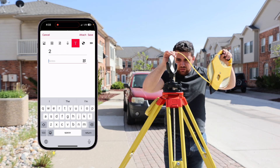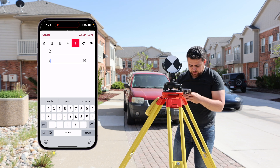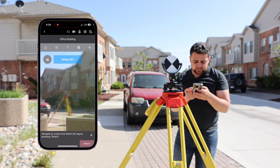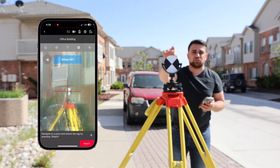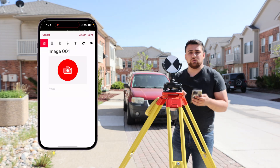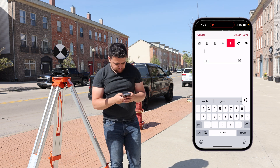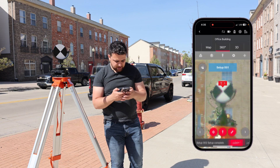This right here is target number two, and the height is 4.86 feet. I'll select attach to attach this annotation somewhere in the scan. It doesn't need to be exactly in the middle — just relatively close — since we'll select the actual center in Register 360. I'll add one more annotation for target number one, with a height of 5.10 feet, and attach it to the first target.